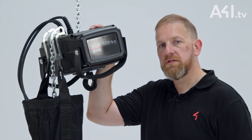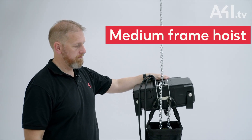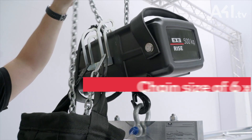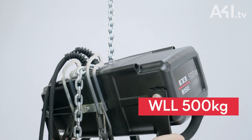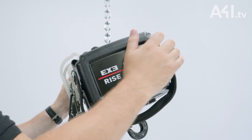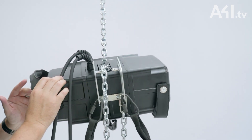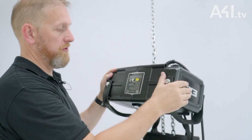Our medium frame hoist is the newest member of the ExiRise family. With a self weight of around 24kg, it uses a 6mm by 18mm chain and delivers a powerful 500kg capacity with an 8-to-1 safety factor from this compact unit. A die cast body with a matte black finish and reinforcement ribs all around the hoist make the hoist as strong as possible.